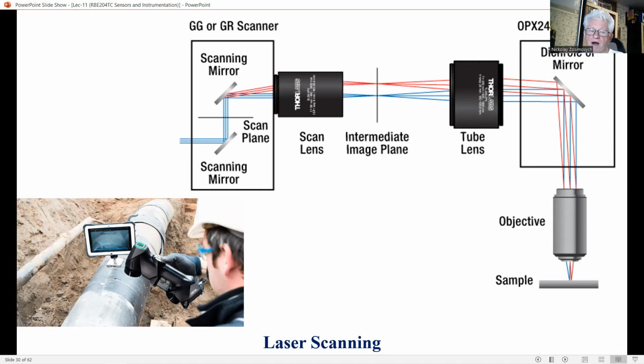A limited number of parallel lines are projected onto the object. The cross-section of each line has a bell-shaped intensity distribution, and the lines overlap partially. When two adjacent lines are transmitted simultaneously, the total intensity of the projection shows a peak at a position that depends on the relative intensities of the individual lines. By controlling this ratio, the peak value shifts across the object under test over a distance about equal to the line separation. The range can be extended simply by adding more lines. Based on this principle, an acquisition time of 6 microseconds was obtained with a spatial resolution of 1 micrometer over a scanning area of 22 times 24 millimeters.